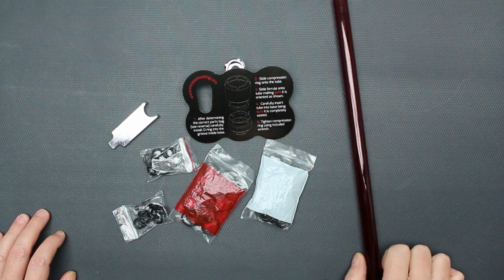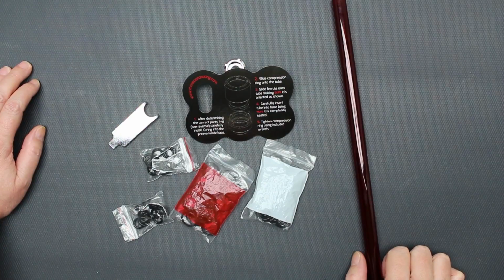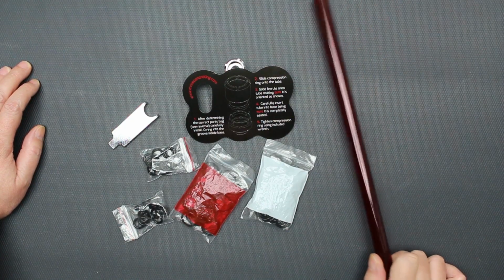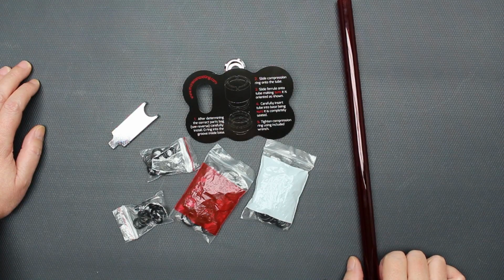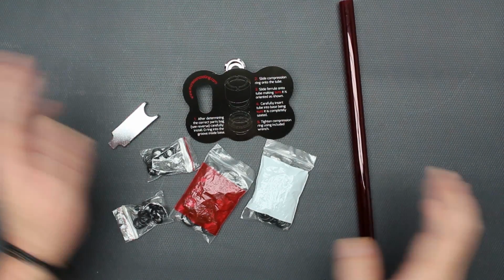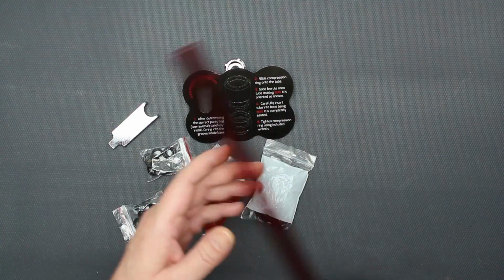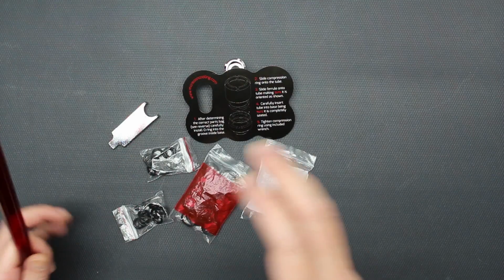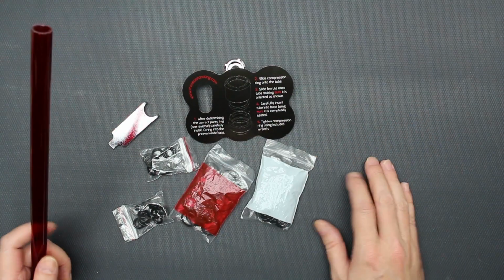Rigid tube is an extruded tube. As a process, the way rigid tube is manufactured, it's done by extrusion, which is just not very accurate. Most factories will give you a guaranteed tolerance of plus or minus 3 to 5%, which is pretty substantial size variation. You'll also find that the tube between different manufacturers and even between batches, there's quite a bit of variation.